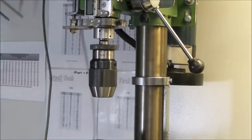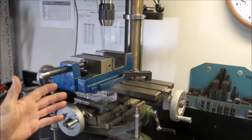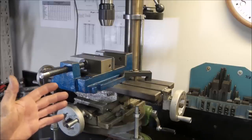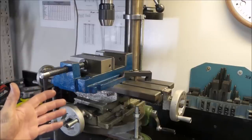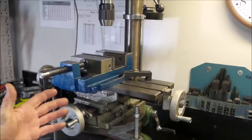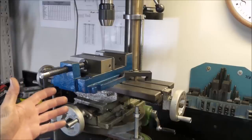Now, let's move on to the XY table. As far as the device goes for moving the workpiece around while you're performing different processes on it, you can't beat a heavy cast iron XY table. Once again, the heavier something is, the harder the forces acting against it have to work to move it. Think back to a proper mill. Don't try to use a cheap XY drill vise. They're simply not up to the task. And even cheap alloy XY tables will let you down in this regard.